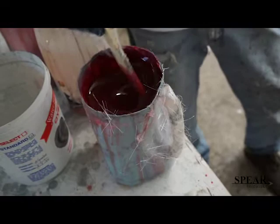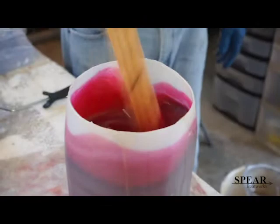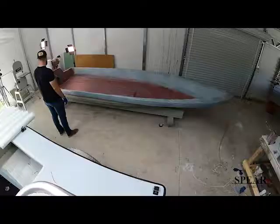I will provide you with a dispenser for the MEK. And when it cools off, you can use DDM9, but when it's warm, you should use Cat 11 for your catalyst. When I mix the resin, I give it at least 150 or 200 strokes. If you're using colored resin, it looks like it's mixed in about 10 strokes, but it's not. You need to spin it a lot to get it to mix at the molecular level. I always spin it at least 150 or 200 times before I go to apply it.